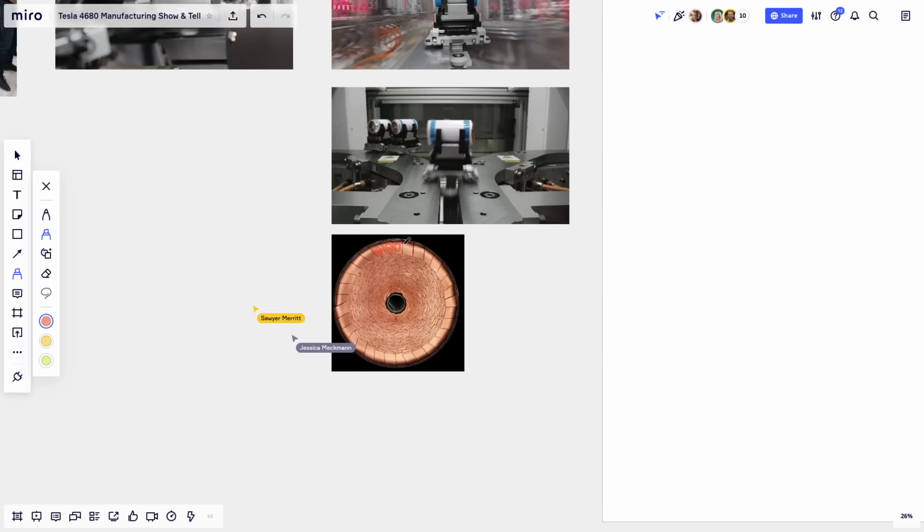Once we looked at the mother foil, the first picture we saw, the flags weren't cut yet. This is cut later on, just before the winding. Just before the winding, all these little cuts are made into the foil, and they're rolled and all sticking out. Then a process lays them all flat in a type of Rosetta pattern. So you end up with a flat surface on each side of the jelly roll, almost flat, not perfectly flat.